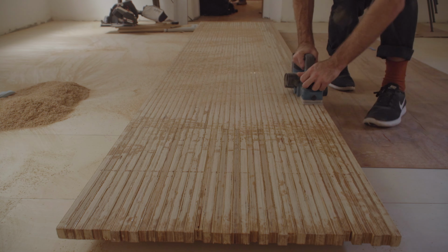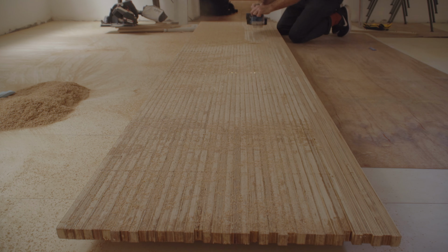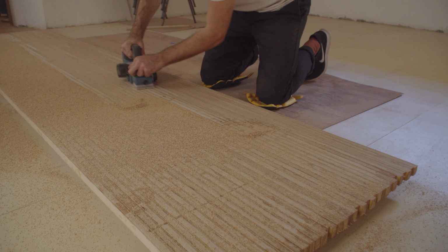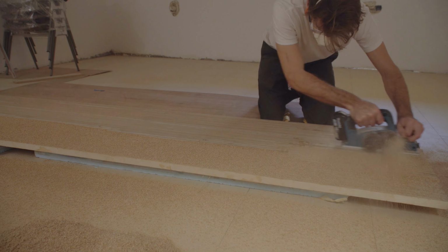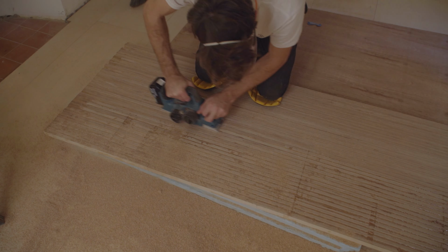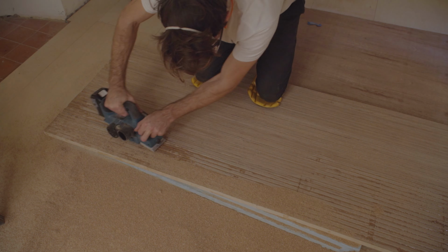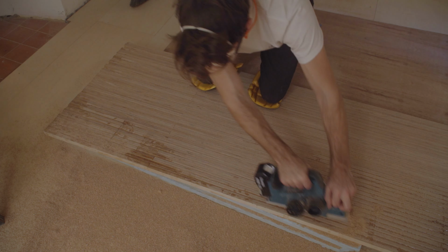After transporting the cured countertop to the site, the next step is to skin the deck. I've worked for a few years as a surfboard shaper, and for me, I feel very comfortable using an electric hand planer. In general, as I'm only working with a small deviation in surface variation, I set my depth at 0.5 millimeter and do my initial pass by eye and feel.